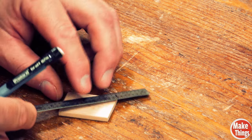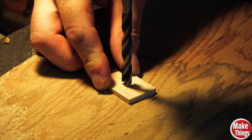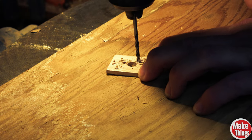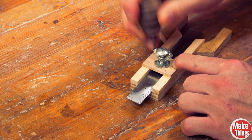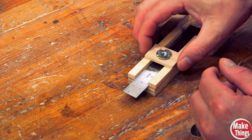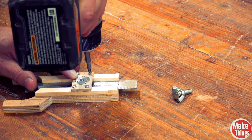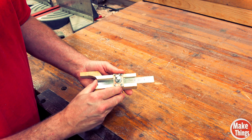But if you're looking for a clamp, I've got that covered too. I grabbed a thin piece of wood, found the center, and added a hole to house a t-nut. I drilled holes for the tines and epoxied it in place. To add the clamp to the gauge I used CA glue to hold it in place while I drilled out four holes — four screws and it's done. Like I said, it really can be made in about 30 minutes.